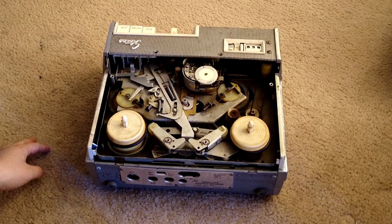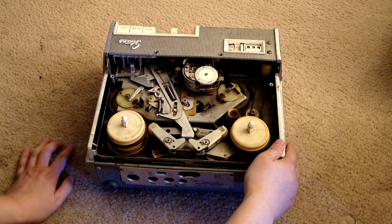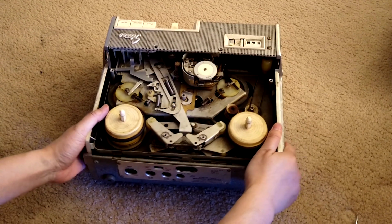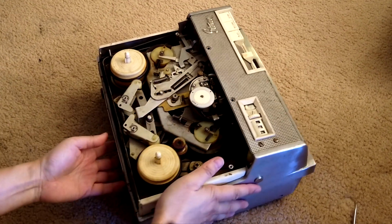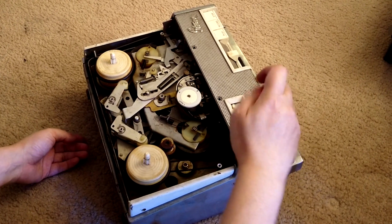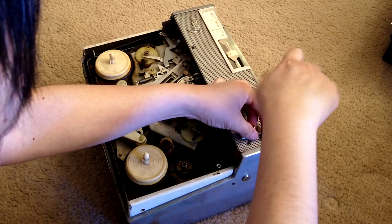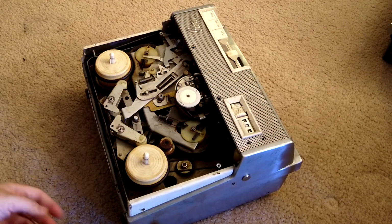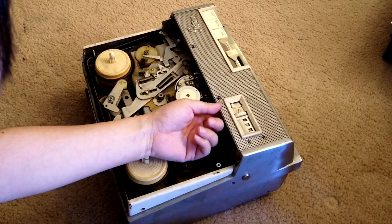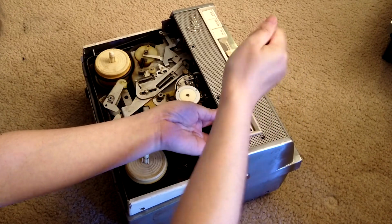This one of course doesn't work, but I only use this to show you how to change the bulb, so that doesn't matter. First, if you want to change the bulb for the counter, you don't have to disassemble everything. All you need to do is lose the 2 screws here, then the counter should be off. So let's see, lose the 2 screws here. I think I can. Nope. I think no. Oh yeah, I think we also need to lose a screw. The one screw here. Yeah, that's right.